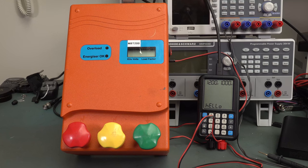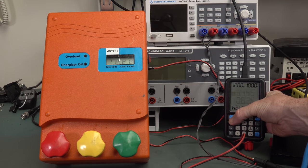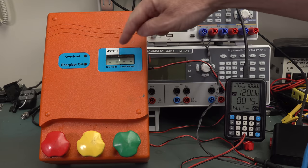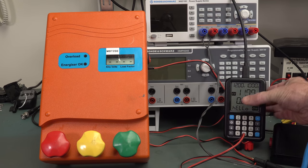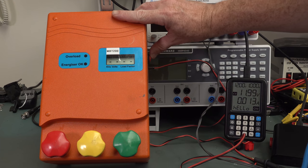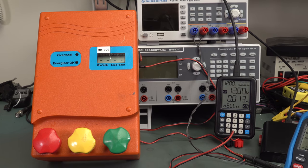I'm going to power this thing up. I have no idea if it works — it literally came from the dumpster. I'm going to power it with my microsupply. As I've said many times, anything over 12 volts DC scares the hell out of me, so I'm not going to be anywhere near this sucker. Here we go — 12 volts, one amp, turning it on. Oh, it works! There are digits! Kilovolts, load factor. There's a dash-dash-dash. It's drawing 14 milliamps quiescent current, then it dies out. All eights — that's a power-on test. So let's switch it on... nothing. Maybe it was already on. Either way, there's no energizer light on there.